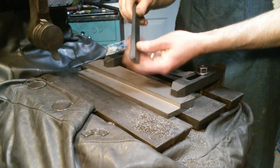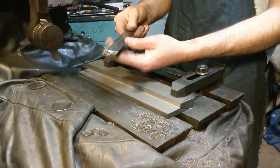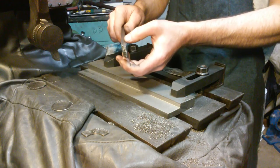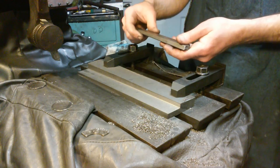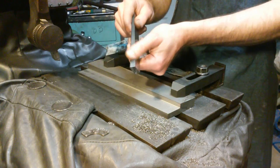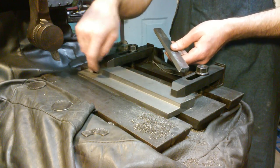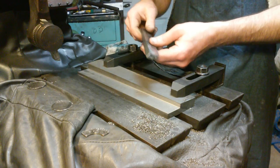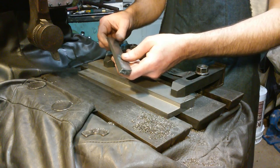Next we need to cut the sides. They're rough-machined but need to be accurate in thickness because when you slide the gib up into the compound, the edges are very close to touching on both sides. My plan is to slide this part to the edge of the shaper table, set the compound at the right angle, and cut one side. Then I'll part it off from the stock, flip it using clamps, and cut the other side. Making a gib is a fairly complex process — that's probably why you don't see much information on it, especially on YouTube.